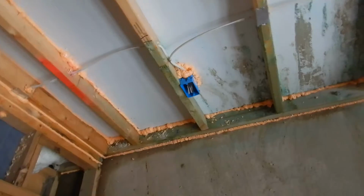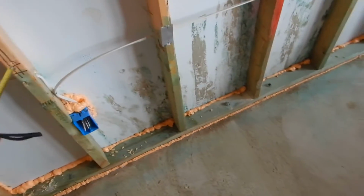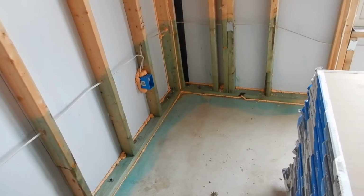Moving on along. Okay, we added some nice nailing plates over here inside the parent bedroom west wall. That one measured fine, I think. I might have to come back. Yeah, we need a nailing plate there. See, I had a nailing plate right here, a nailing plate right here. We need one right here, one right there, and one right there. See, they added them here, and as we get further to this wall, they start getting farther away, so it's not necessary. But it became necessary on this end of the room, but they only put 2 nailing plates in.